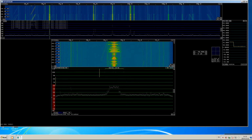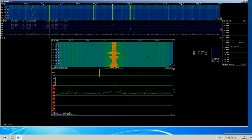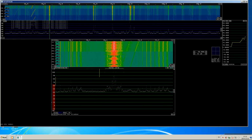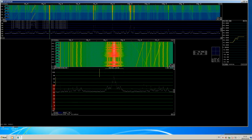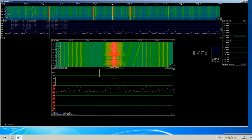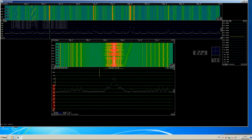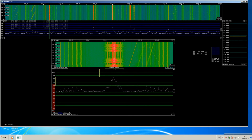And increase the gain to get back the same level here. And the intermodulation signal is rather weak. And I continue to increase the gain. And here it is. And it's clearly weaker in relation to the FM station. But not much weaker. Here 10, 20, 30, 35, 40, something.